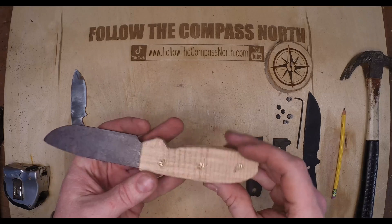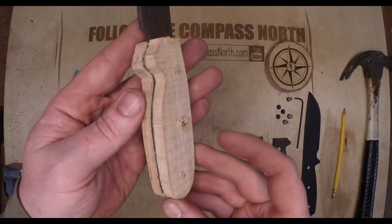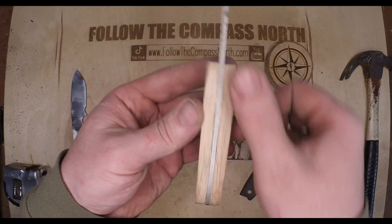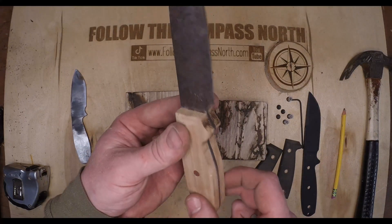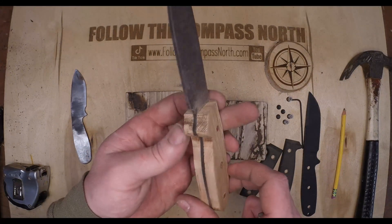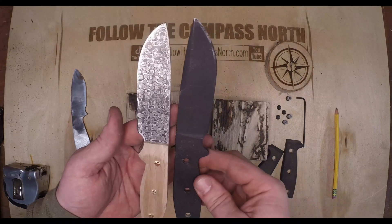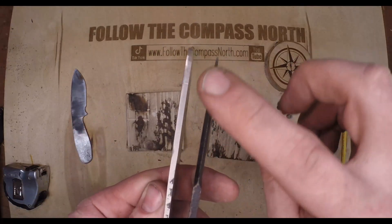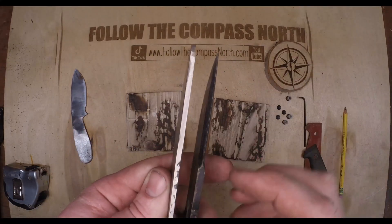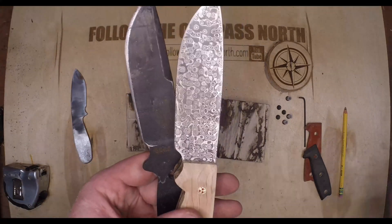If you're building your knife and you get to this point and your handle looks like garbage, that's totally normal. This is rough cut wood larger than it should be and it takes significant sanding to get it down to something that looks actually presentable. I've already taken a couple passes at the belt sander so it doesn't look as messy but we still need to trim it down quite a bit. I will not be beveling the spine of this blade because I like to have a little bit more strength in the tip even at the expense of being a little heavier.